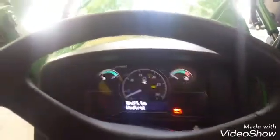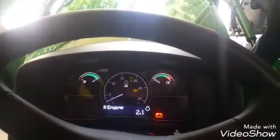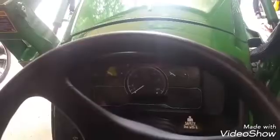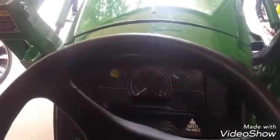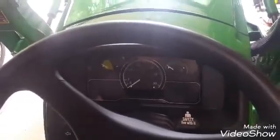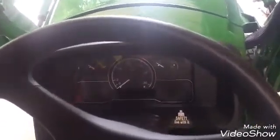Now I'm going to cycle the key switch off. We're going to disable the RIO switch on the tractor so that when we want to back up, we don't shut the mower off.